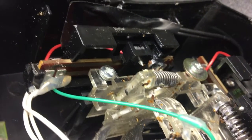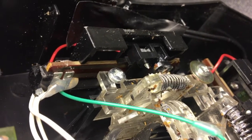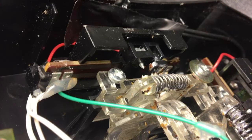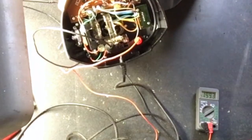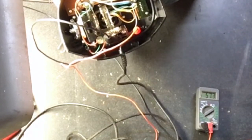See that little black slider sliding along that board? That board is actually the potentiometer and the slider is controlling it. There are three wires coming out — in, out, and ground — just like a regular potentiometer. I hooked the potentiometer up to the multimeter and as you can see, as I move the joystick the resistance is going down.